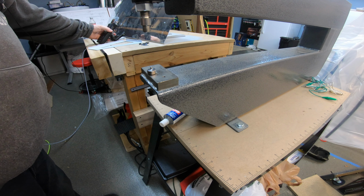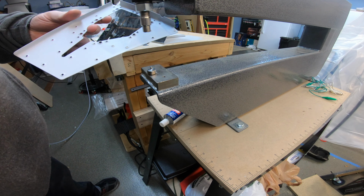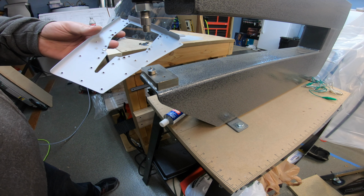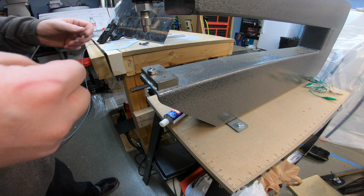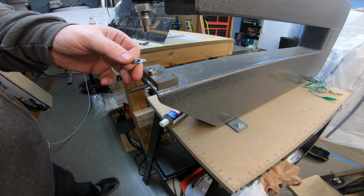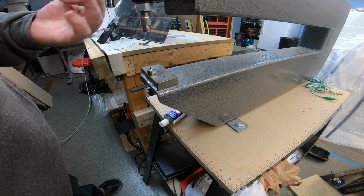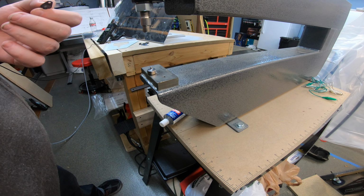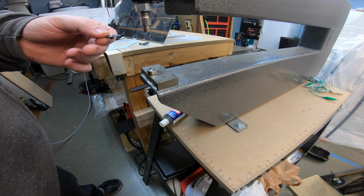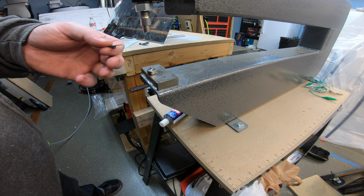I've gone ahead and back riveted all of the stiffeners onto the left elevator skin. Now I'm working on the trim access plate here. So for the nut plates that go around the perimeter for the trim cover, I went ahead and dimpled the holes afterwards. I read about the NAS, I believe it's 1097 rivets, where you can actually kind of countersink the skin a little bit so you can end up keeping these plates flat. That's how I'll probably end up doing this in the future.